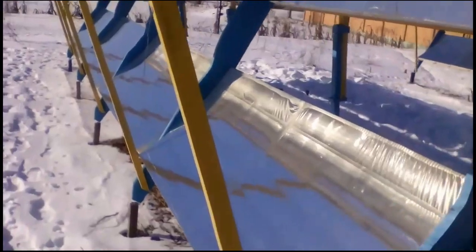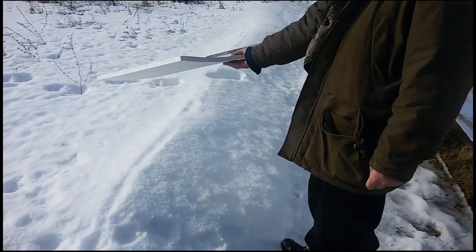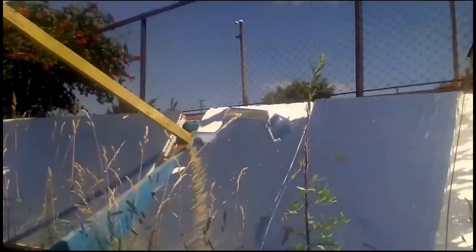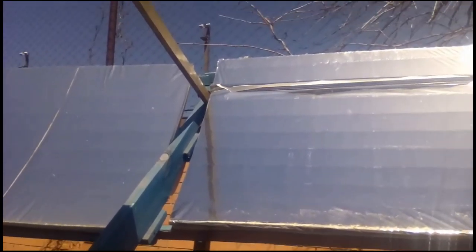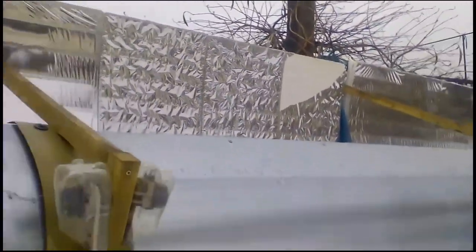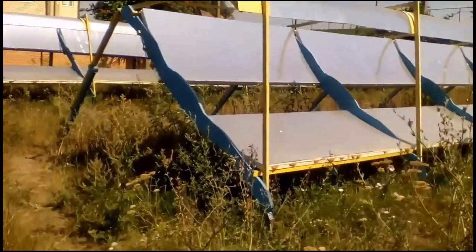However, more than 80% of the mirrors of my solar station are based on reflective Mylar film which is glued to a thin sheet of cheap expanded polystyrene with low density. Of course, this type of mirror does not have a long lifespan, and now I am showing some old mirrors which need replacements. I usually do my mirror replacements every 18 months if the mirrors are based on the cheapest Mylar film with a cost of 20 cents per square meter, and the main reason for their replacement is the deterioration of the reflectivity of their Mylar film. However, if I glue the film not with an acrylic sealant but with polyurethane foam, then the lifespan of the mirrors is about 6 months due to the destruction of the foam by solar radiation. We see that the reflective film of the mirrors is wrinkled due to frost, but the appearance of the sun noticeably smooths the wrinkles, and warm weather solves this problem completely.